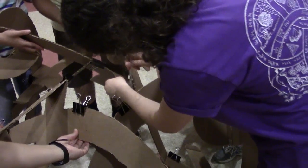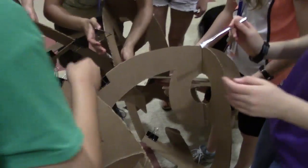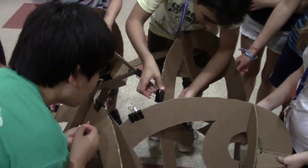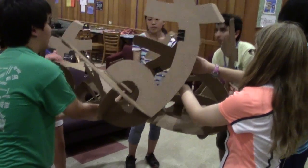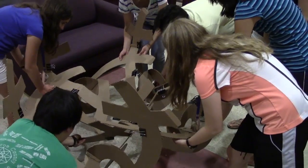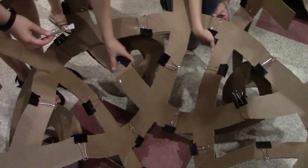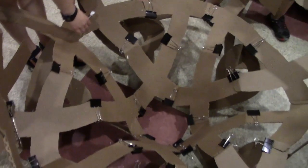You should first clamp the modules together without glue to see how everything fits. When it looks right, take off the clamps one at a time, brush glue in the flap, and reclamp it. We held the parts in the air to start because it's best to see it from the outside when comparing to the computer animation or the paper model. But now the first five modules can sit on the floor, giving us a base to add to. We're using a convention that the handles of the clamp are in one position before gluing and in another position after gluing, so you can easily see which joints still need glue.